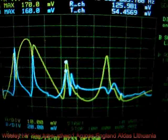We don't have to read it. This shows how much impedance, how much capacitance it does have at a certain frequency. So when we go back to the line magnitude, this is what we have had. Change a little bit, not much. As I say, we don't have anything solid right now. We go back to the highest peak. Where is the highest peak? Marker.